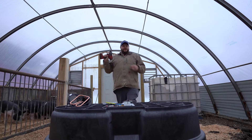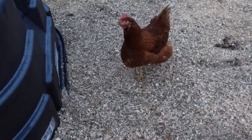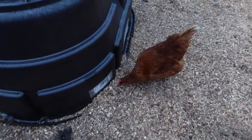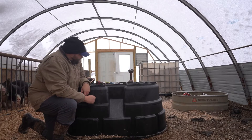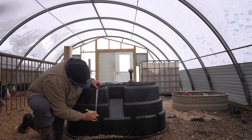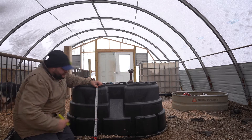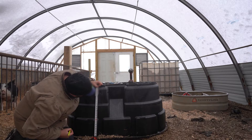I forgot to mention — a drill comes in real handy to operate those drill bits. And of course chickens are completely optional, but I've got to be honest, I find they don't help the process very much at all. Working off the front side of the tank, opposite of where the drain plug is, I'm going to take my tape measure and measure about eight to ten inches down from the bottom. Depending on how the tank is made you may have ridges and have to adjust a little bit.